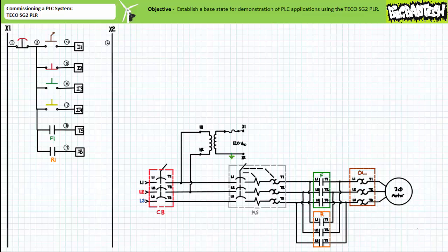Note wire three is not a single wire, but rather the pooled connection of all upstream terminals of field input devices intended to operate at 120 volts AC.